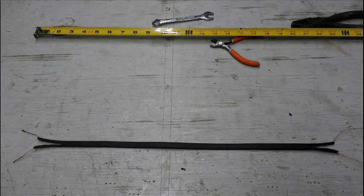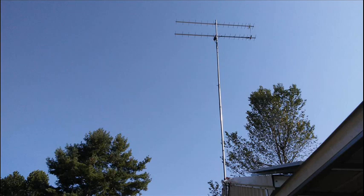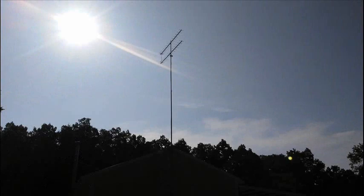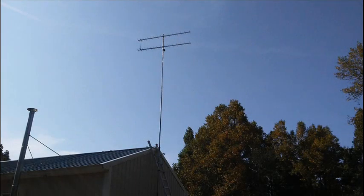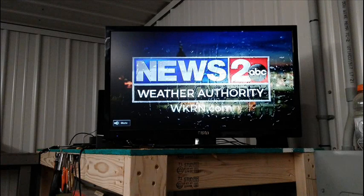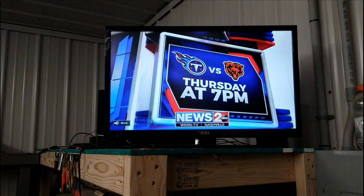Here is a photo of the 605 MHz phasing harness. This phasing harness is 19.5 inches in length to the start of the stripped-out wires — 19.5 inches is one full wavelength for 605 MHz. I built, mounted, and co-phased a second version 2.0 to the first version 2.0. What a big improvement over a single 2.0! Now WKRN Channel 2 has fewer pixelizations and dropouts. The two co-phased 17-element version 2.0s reduced pixelating and dropouts on WKRN Channel 2 down to a couple of hours in the middle of the day, from around 12 p.m. to 2 p.m., and WKRN is not pixelating or dropping out at night.